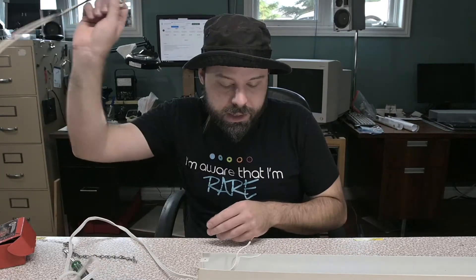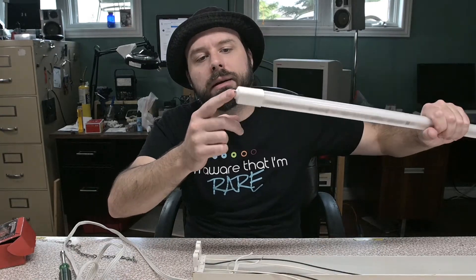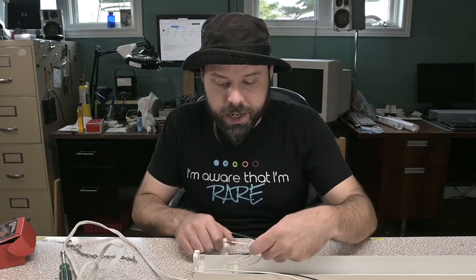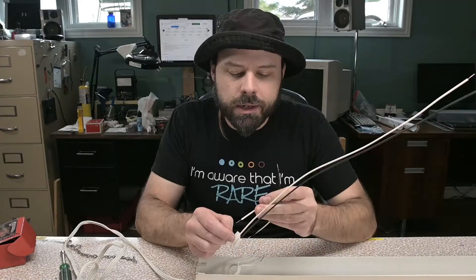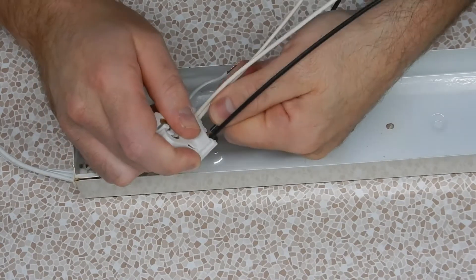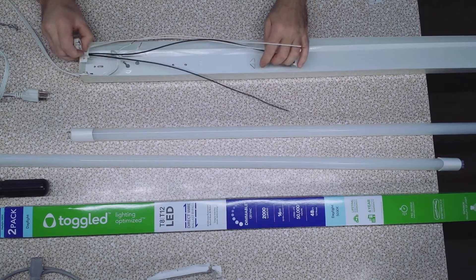So the bumpy side will be the white wire and the smooth side will be the black wire. Obviously, when you're taking it apart, pay attention to what color code goes to what, because there is a chance it could be backwards — I've seen it happen before. But typically it's smooth = black, bumpy = white. These guys are just going to go in here. All you have to do to make these bulbs work is get 120 volts to one end. They're set up for you, so you don't really have to worry about which one's black and which one's white. However, you're going to want to jumper these together — bring your wires around and push the white into the second hole and the black into the second hole. Just like that. Now they're jumpered together and both bulbs are going to work together.